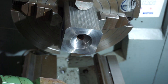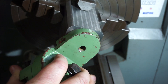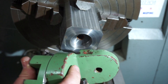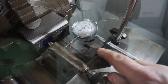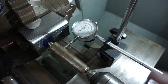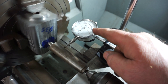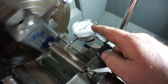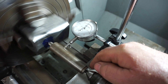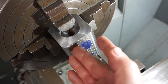Let's just see if it fits — yep, beautiful. So that will give me another option later on. I've got the old dead center up the live center trick, and I've clocked this up in the four-jaw. It's not perfect but it's close enough. I'll just spin that gently — you can see the needle just bouncing around a little bit. Good enough for me. I just marked it and center-popped it so it's close enough. I'm going to run a pilot hole through this first, then a half inch through bit, and then I'll do some boring.